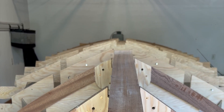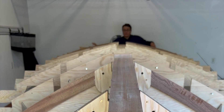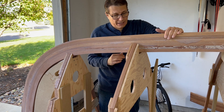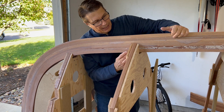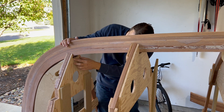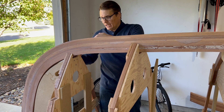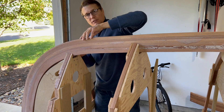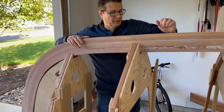I'm feeling pretty good about this. Coming all the way to the back of the boat. The next step here on the strongback is to seat the stem properly into the frames. When you cut these on a CNC, there's a rounded corner here and they fit kind of tight. So I'm going to widen them up, square them out, and then I have to bevel them to fit the curve of this stem. That will be in two videos from now.